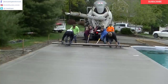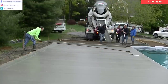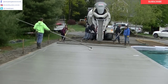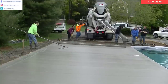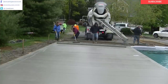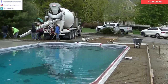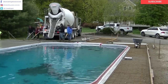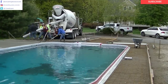As you can see we're coming down that wide side now — that's 16 feet wide. The other two sides are four feet, one side's eight feet, plus that little walkway you see there on the right. We're almost done with this truck. It's going to run out right about here and then we'll get onto that second truck. You can see that was me bull floating there. We'll get that truck out of there — here's the second truck. We're going to keep pouring the same way and work our way around the pool.